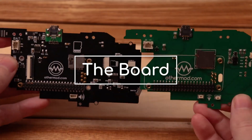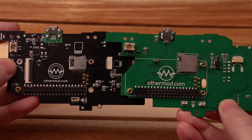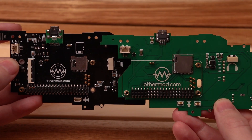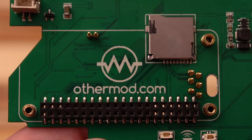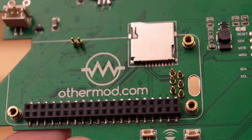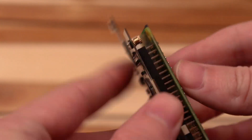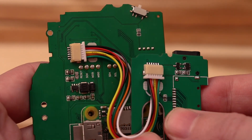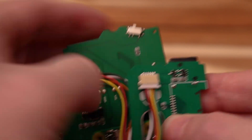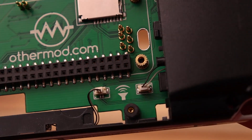And here's the board. Sitting next to the old version 4 board there's a lot of similarities as far as the shape and position of the Raspberry Pi and SD connector, but things are a lot more refined and the board no longer requires any case modification on the PSP shell — meaning the process is completely reversible if you want to take your PSP back to stock again. The board also has a female header for the Raspberry Pi so installation isn't even permanent. This was probably the largest source of headaches in the last board because Raspberry Pis do occasionally die and it's no easy task removing one that's soldered. The headphone board attaches using the six-pin JST cable and you don't have to solder that either — it's male on both ends so you just plug it in. And the last big change is that you no longer have to solder wires to the PSP speakers; I found the connectors that match the speaker cables so you can just plug the original speakers right in.